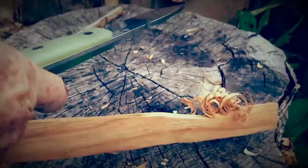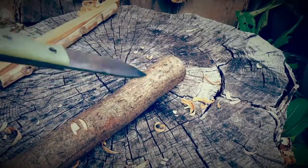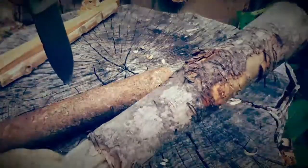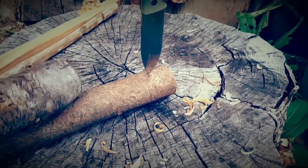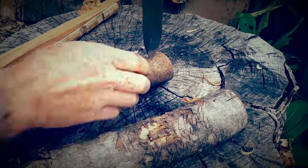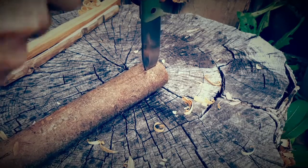Here's another way using the same piece of cherry. Take a 10, 12, 13, or 15-inch piece of wood — whatever you have available. Drive your knife tip into it toward the far end. This log wants to roll so I need something to hit with — a baton, ready-made. You want a stick with some decent size, two or three inches across. Just drive the knife tip in with one light tap, get it set, then drive it down — just don't go too far or you'll split the wood.